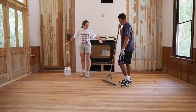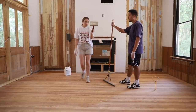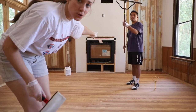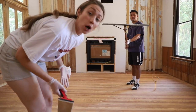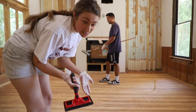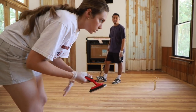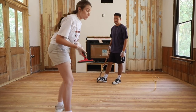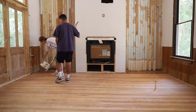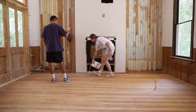I set it on those corners here because those were gonna be covered by cabinetry anyways. I have this little felt pad, and a squeegee, a T-bar, rather. Basically, what we're gonna use to move it around. This is great for water-based, I've read. If we were doing oil-based, we would use different products like lamb's wool or rollers or something. You can use rollers too, I think. We're pouring a 6-inch line and we're keeping it wet. With the grain.